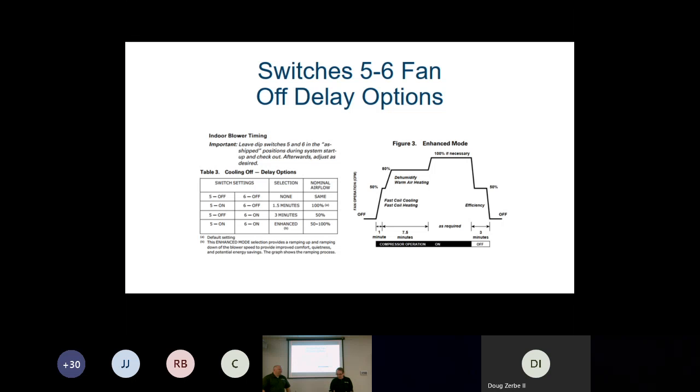We're going to have to put refrigerant in here." And all of a sudden, as you're looking at it, wait, whoa, hold on a minute. It's coming up a little bit. It's coming up a little bit. Well, what just happened there? We had 50% airflow for the first minute. Now, all of a sudden, we're going to run 7.5 minutes at a lower airflow, and we're going to almost get there. And then if we wait long enough, after about 10 minutes of runtime, that coil's wet enough, airflow is happening, everything's right, superheat is now being established. We can now check our charging on that unit.